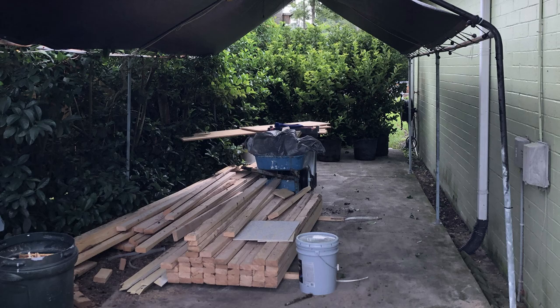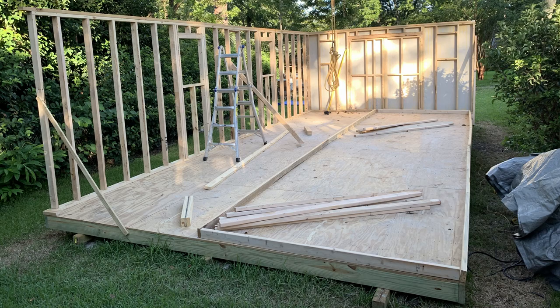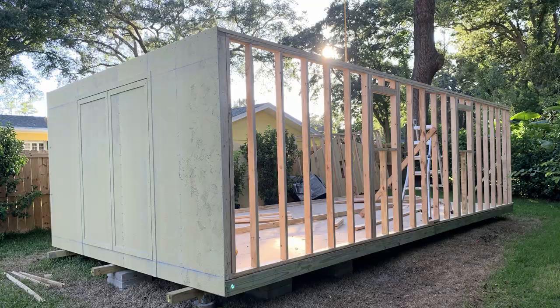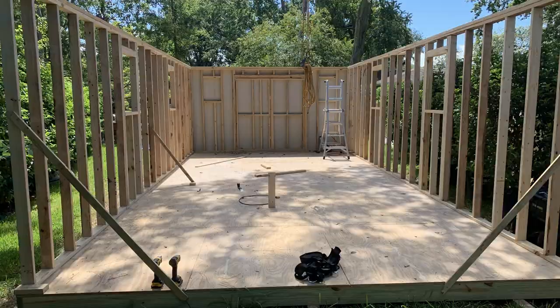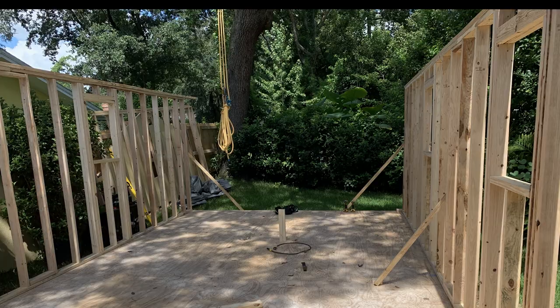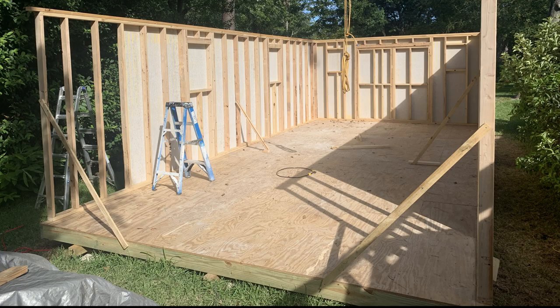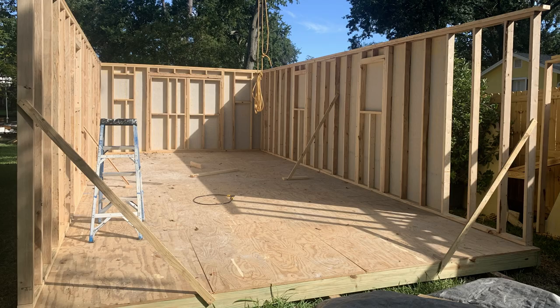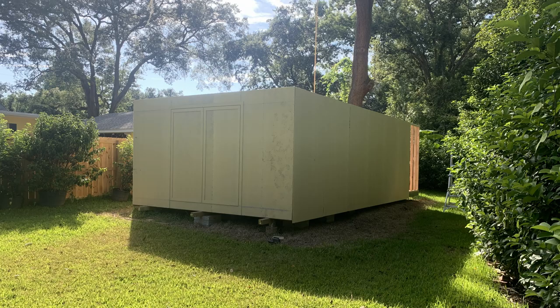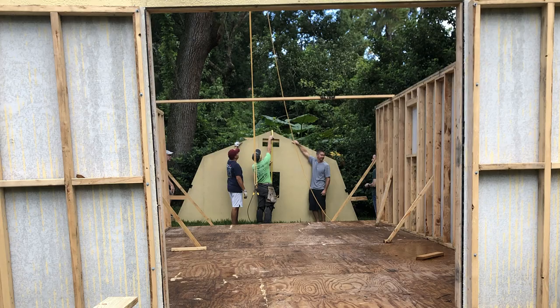Here's how I kept my supplies as I ordered them — I did all this from scratch. Built the second wall in place; got the trusses there with standard framing, the windows, and all of the top plates and bottom plates in there. Trying to keep everything square as possible from the ground all the way up. The second wall is there, supporting it from the edge, and it's starting to actually look like the size and shape of a 14 by 28 shed.